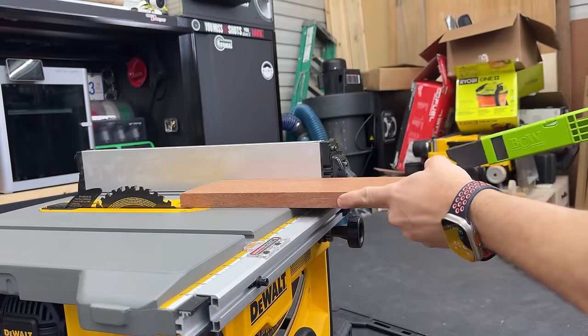The first tool I recommend for your table saw is a featherboard. My favorite is the Bow featherboard — they fit in a standard T-slot and you tighten them down. The feathers bend forward toward the blade as you push boards through. If something binds and starts to kick back, they lock into place and help prevent kickback. Another great feature is they push pressure toward the fence, keeping the stock against the fence and making cuts more accurate. Always set a horizontal featherboard up before the blade — never at or behind the blade, as that causes pinching and kickback.